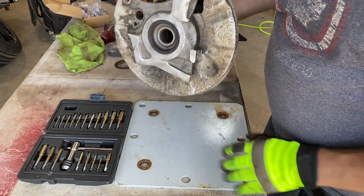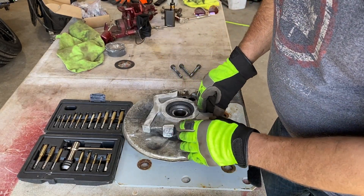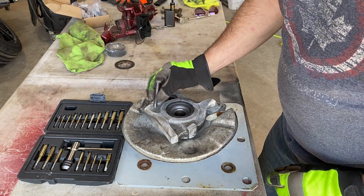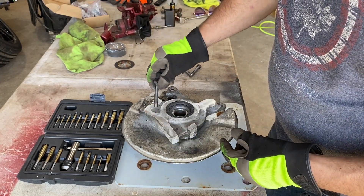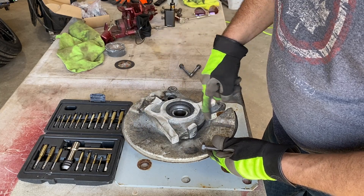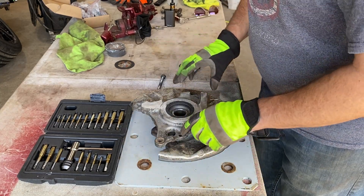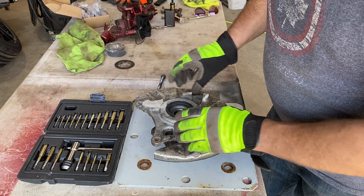I now need to figure out how I'm going to attach these plates to these hubs. I have decided I'm going to drill some holes in the thickest parts of the aluminum hub, tap some threads, screw in some high tensile hardened bolts. Obviously not this long, I'll need to cut them down to size. That should be enough to hold the plate on. I've got a cunning plan to make these plates look a bit more stock factory. So let me drill some holes and I'm going to try one first on a spare bit of aluminum to make sure it works.